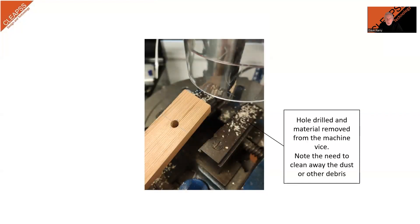After finishing the drilling operation, the operator should withdraw the drill from the workpiece before switching off the machine. The operator should wait for the machine to come to a complete stop and then carefully remove the workpiece, bearing in mind that there may be waste materials such as dust or swarf on and around the work area, and that the material and drill bit may be hot. If further holes are needed with the same drill bit, the machine should be left in a clean state ready for the next user. Otherwise, it would be good practice to remove the drill bit and return the bit and the chuck key to their respective storage.